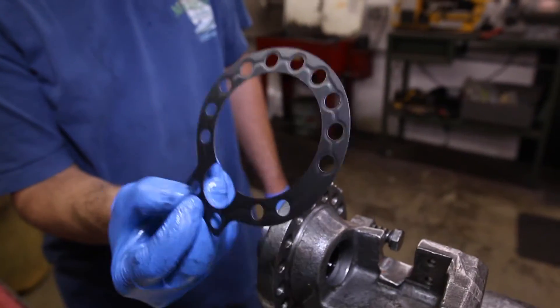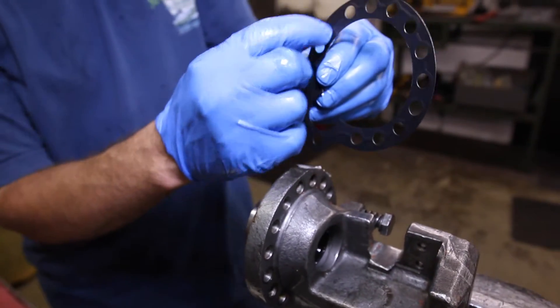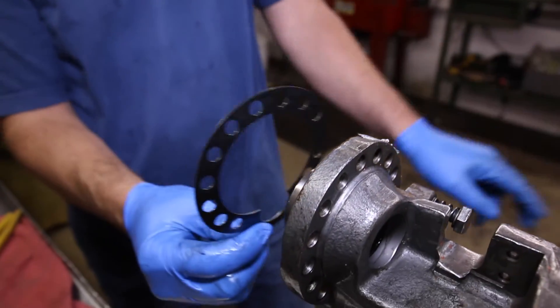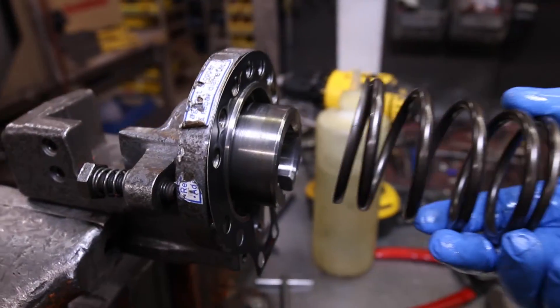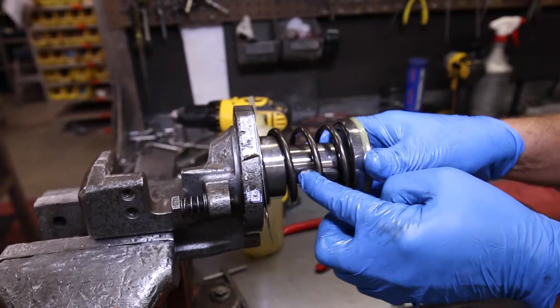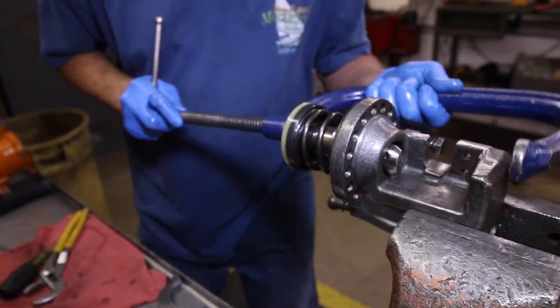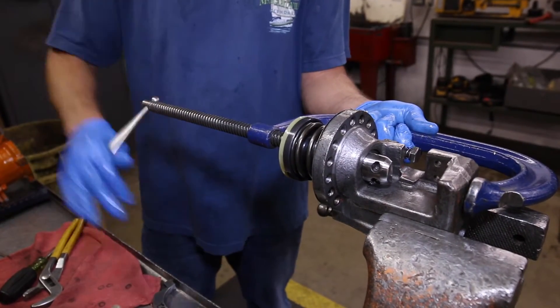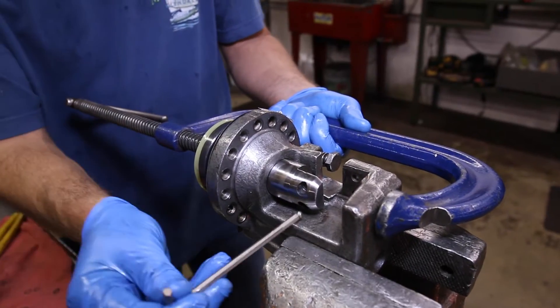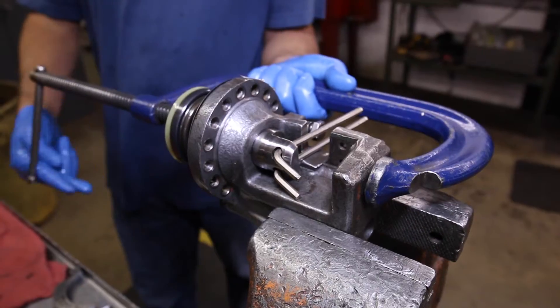Put the other cylinder gasket in place and assure the side with the space between the holes is on the left side. Put the big spring in place and then insert the piston and push to make sure everything is smooth. Secure the piston with a large C-clamp, then place two allen keys in the block holes to prevent the piston from retracting, and remove the C-clamp.